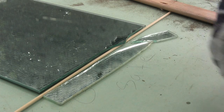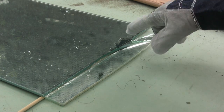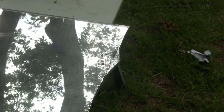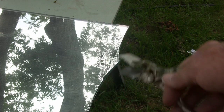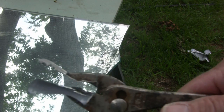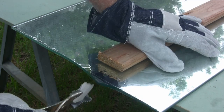And this is what sometimes happens — we have got a bad break in there, so I'm going to get my pliers and see if we can't break that little piece off. Normally what happens is it will crack up and we lose our piece. I can't find my wide pliers, so we're going to try with these. I've got duct tape on there to keep steel away from glass — you still want something on there to keep yourself away from breaking glass.